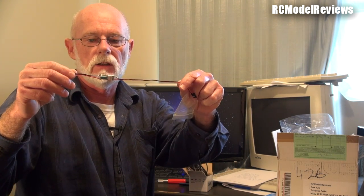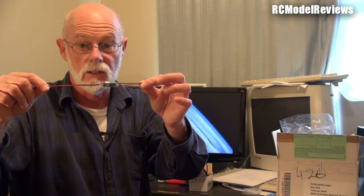It's the little UBEC. It's a little switching voltage regulator for your RC models, and I think it'll take, I can't remember what it takes, was it output 5 volts, input, doesn't tell me how many cells, but I think easily 3 cells, probably 4 cells. I'll check it out. I'm going to review the whole thing anyway, because what I like about this is it's so small and light, and it's 3 amps supposedly according to the specs.